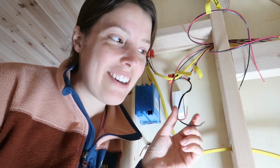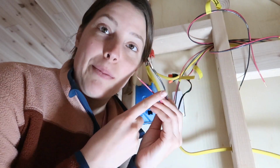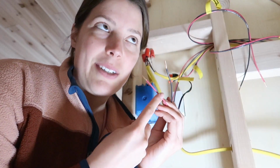And so if I connect it that way, then the light turns on. So I think our issue is that we wired every single one of the lights wrong in our ceiling, and we're gonna have to pull them out and switch the wires so that we have white going to our black wire and black going to our red wire. So if you're yelling at your screen right now, don't rewire all your lights. Don't worry, we aren't. Last night we talked to Gavin's dad about it and realized that we can just swap the positive and negative wires that come into our fuse box.